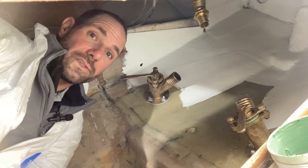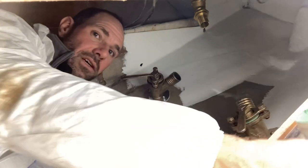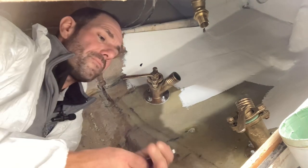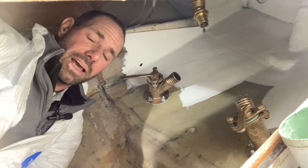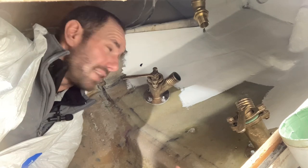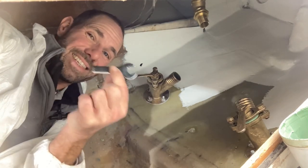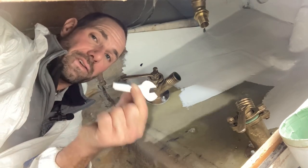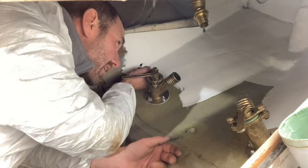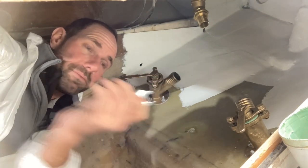The things you will need to do a Blake's Seacock service are a spanner, some grease, probably some valve grinding paste, and some tissue just to clean everything up with. Ideally the spanner you want is a Whitworth spanner — that's a really old English size — but I use a 15mm, which will fit normally absolutely fine. This is a special seacock spanner I have made: it's a normal size spanner but it's been cut in half, because sometimes when you're working on seacocks they're in really difficult places and you need to get the spanner tucked in around bulkheads. I keep it with my pot of seacock grease, which just makes the job easy.